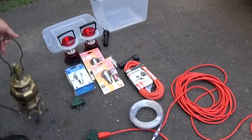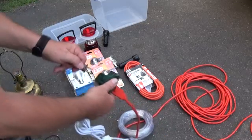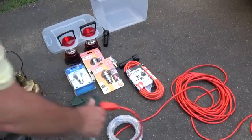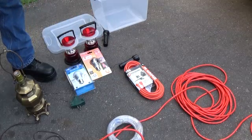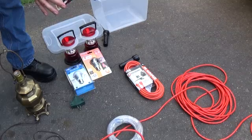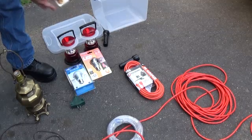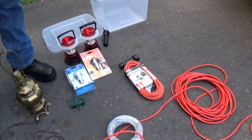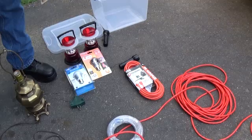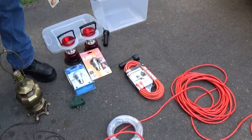With the lamps inside the house, whatever lamps you want to power — whether they're in bedrooms, living rooms, dens, or kitchen — you simply plug these in. Then you choose an LED light. These LED lights are two and a half watts, that's all they draw. The reason I say use an LED light bulb is that a 100-watt light bulb actually draws 100 watts and it's a waste of power. These little lights will produce a fair amount of light and only use two and a half watts — so you can run around 35 to 40 lights for what one 100-watt bulb would normally use.